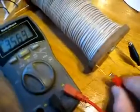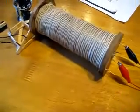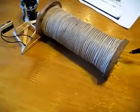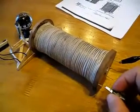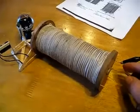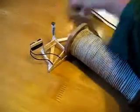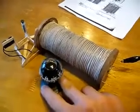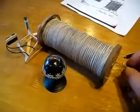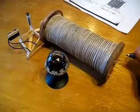That's just a really interesting effect. But the main purpose of this video is to let you know that if you connect wires 5 and 6 and expect to get an electromagnetic effect, you're going to be very disappointed. Connecting one of the outer wires to one of the inner wires gives you a nice strong electromagnetic effect — completely around the coil, we have a nice pulsing electromagnetic field.